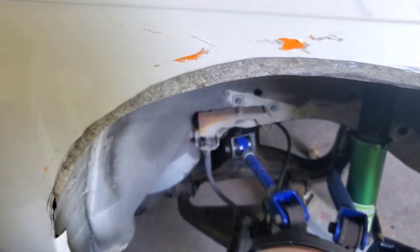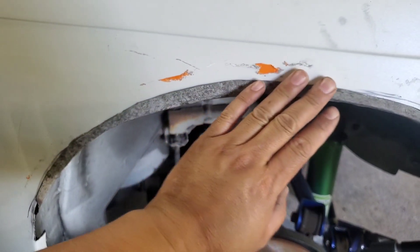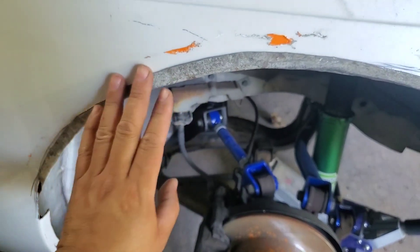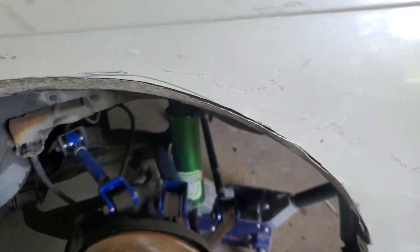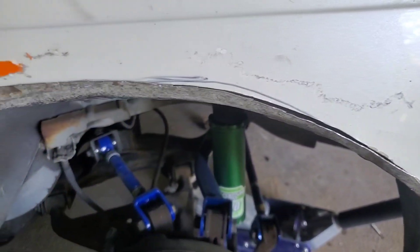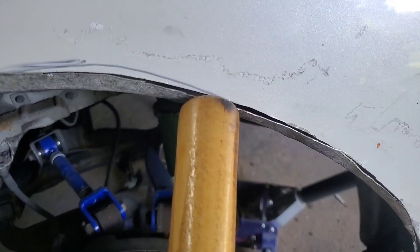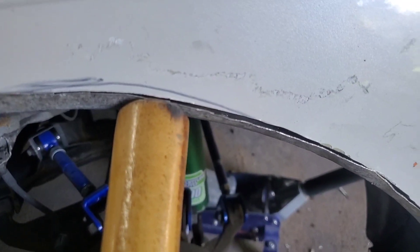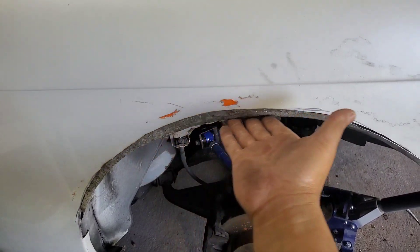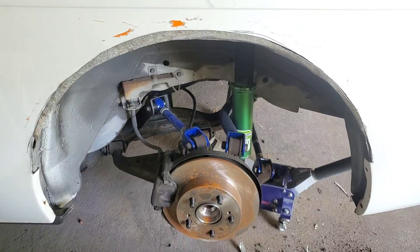I had a little excess — if you have excess, you saw I trimmed it with some tin snips. Had it been the full length, it would have been much more difficult to flip over. I did come up a little short, but when it comes time to weld, this is definitely within welding range. Once I put some tacks and get right here, it will actually get soft enough where I can tack and press up. More or less, that's one way I cap off a rear end whenever I cut out for clearance — and that's plenty of clearance for a 19 inch slam down.